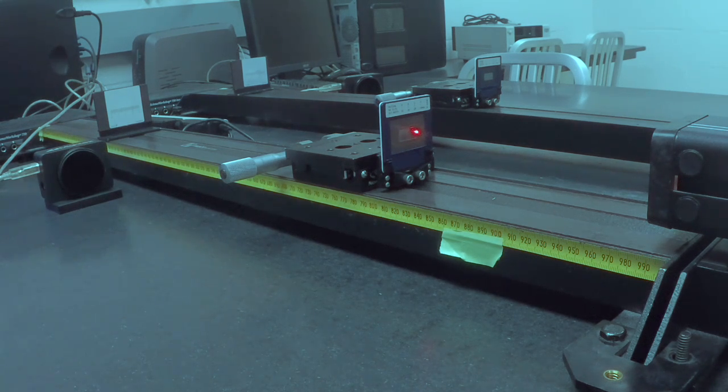Now I will go ahead and turn off the lights to show you how to record the data. Okay, so now you don't see anything. What we will do is turn this micrometer until we are sure that the light from this laser is going through a slit. So in our case here, what we see is the light going through the 0.16 millimeters. You only see the central diffraction peak, and then you will use the ruler on the viewing screen to measure the width of this central diffraction peak.